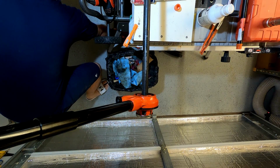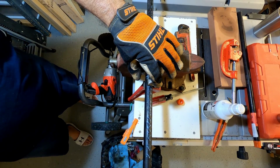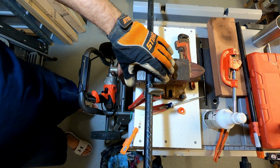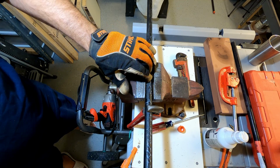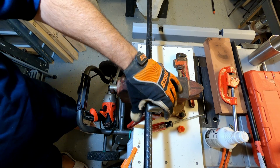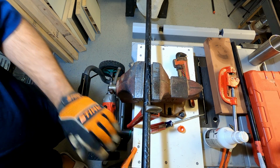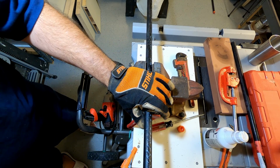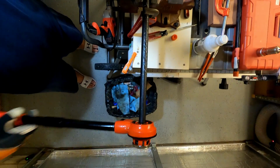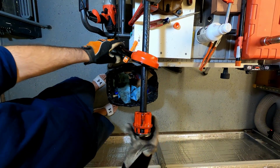Pipe wrench back in there, but we're going the other direction now. So I had to reverse the pipe wrench to this direction so that it would grip when it starts spinning, and then that stops this from spinning the pipe. You see here, I gotta hold it. Not a lot of pressure, so I can let go now because this is really starting to come loose. Once it starts to get like that, you can just do this by hand.